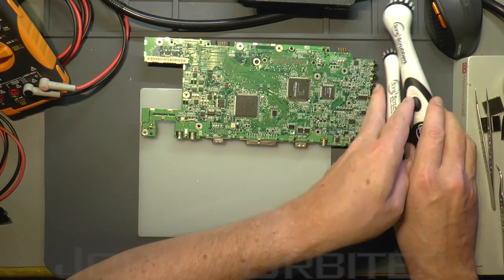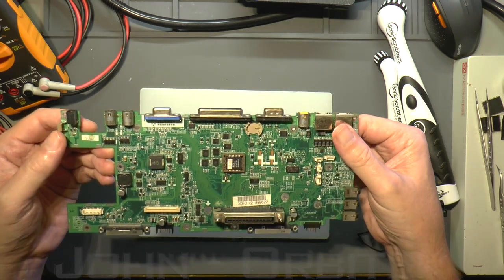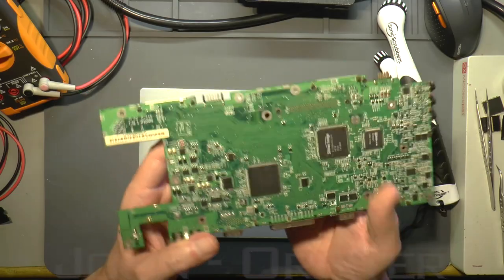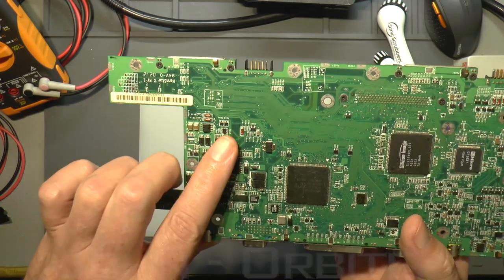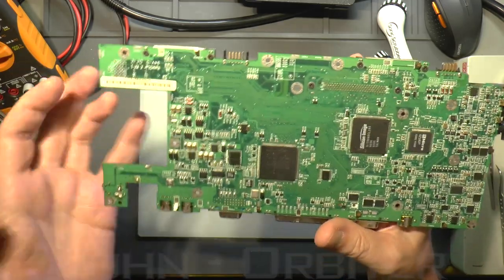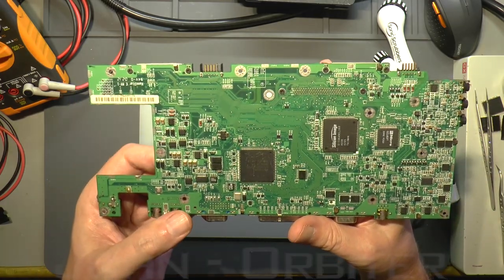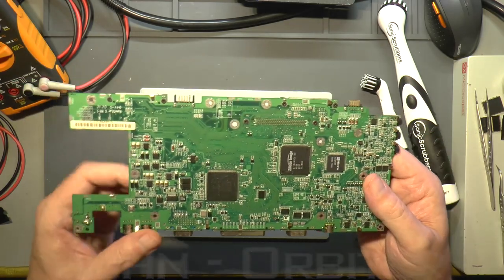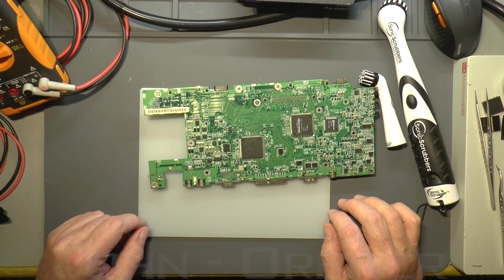So I'll put that to one side. I've got what looks like an old PC board - it might be off a server, I'm not sure. I'm going to put some hot air in a region with a load of flux and burn the flux in. I'll use the 559 flux because it's more tacky than the 213. I'm still using the 213A as my normal daily flux - it worked fine on the audio IC on that iPhone 7. Let's whip a couple of ICs off and put them back on - we'll go into the microscope and make a proper test of it.